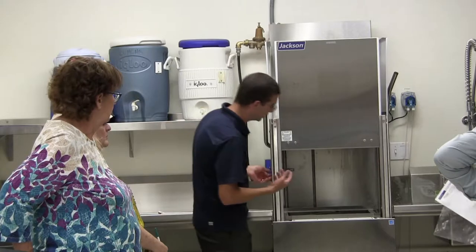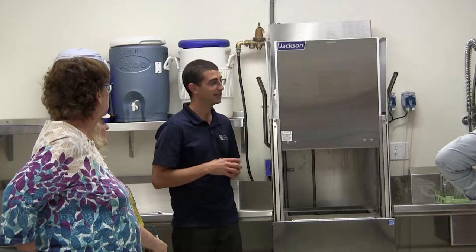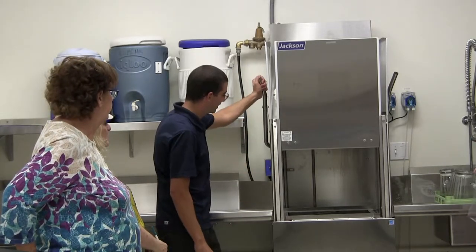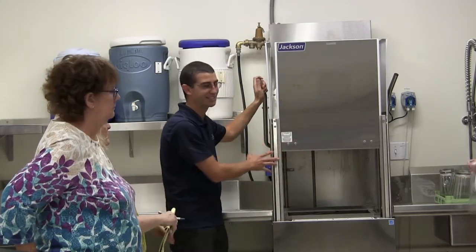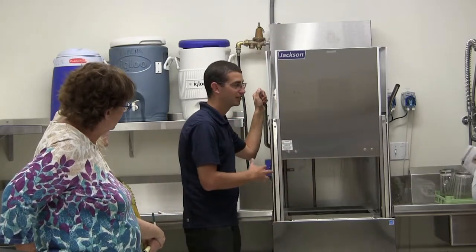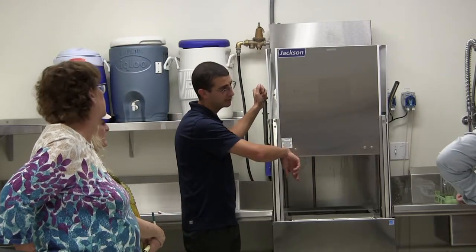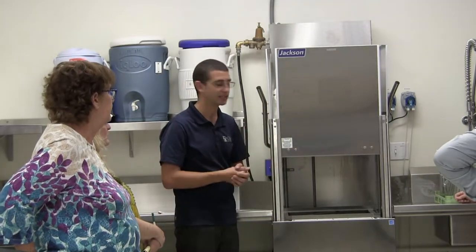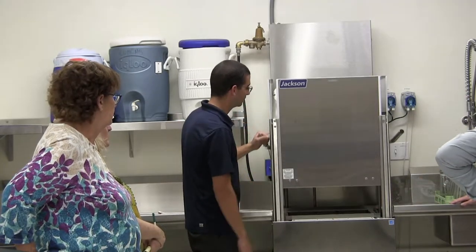If you take off the ends of these caps and you're looking down and you're seeing the hole getting smaller, definitely up your frequency of the deliming so that you can get that back under control. I've had some people where I come in and the hole inside looks like it's painted white. It's not like the machine is adding anything, it's just the water is so bad. So we're able to get that all cleaned out and delimed, and that's good. But there's also a heater element down inside the unit, and that will build up around the heater elements, and then it just takes longer to heat up the water, so it makes it less efficient. So we want to make sure to keep everything as clean as possible.